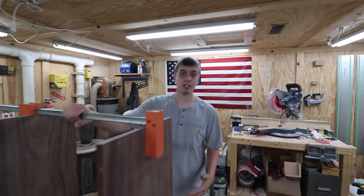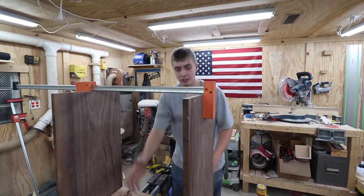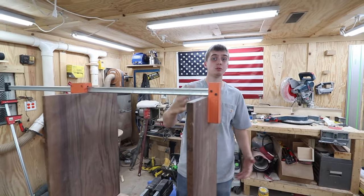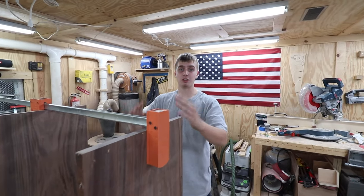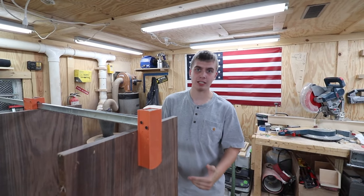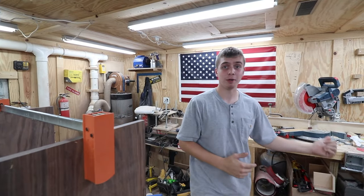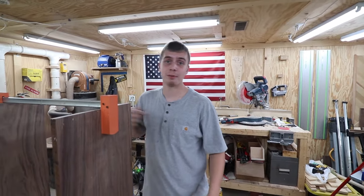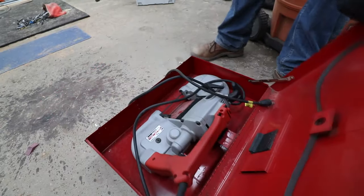All right guys, so I threw my nightstand up on my horses. I threw a clamp on it so that it's the same dimension from this panel to this panel all the way up. So it's 22 9/16. These legs were a little flared out, that's why the clamp's on it. So I'm gonna jump over to my metal vise, cut some 1-inch tube steel, and make a metal frame for the bottom of this thing. So let's get it done.